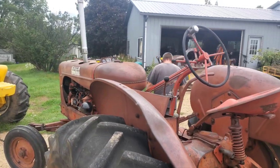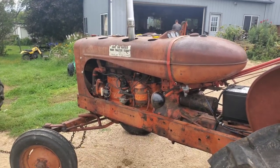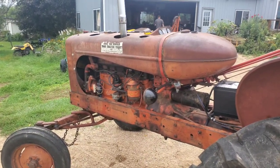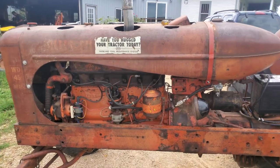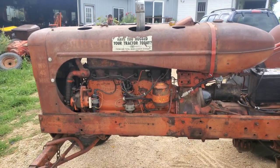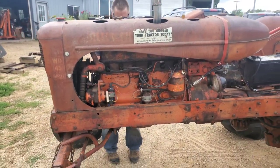These little 230s were maxed out - there's not much clearance inside. Usually when you hop an engine up, one of the things you've got to do is grind out the crank to have reliefs for the stroke if you want to stroke it out. Well, these engines, that was all done from the factory. There's not much left inside of these. They built engines and turned them up - ran them hard it seems. Didn't leave a lot of room for guys to play with them inside, but there are some things you can do to them.